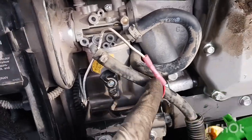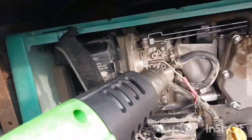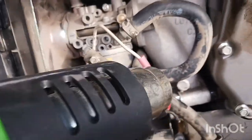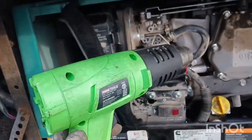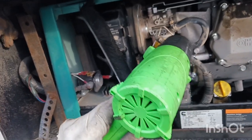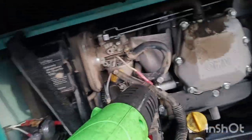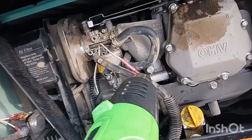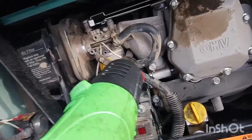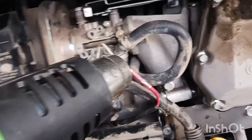I just put it all together and cut the old parts off. Now we're going to melt the heat-shrink connector down for a better seal. This is a heat gun — it really helps a lot in both winter and summer; it has enough heat to close those connections tight so vibration won't let them come out. We're also going to put a plastic zip strap over it, nice and tight, to make it secure.